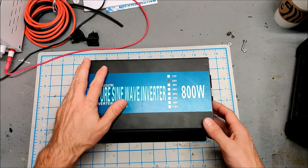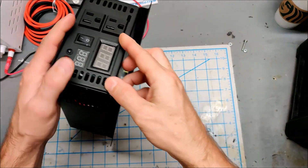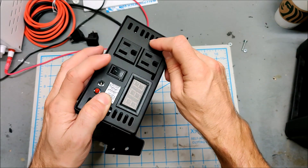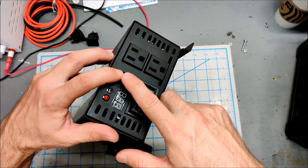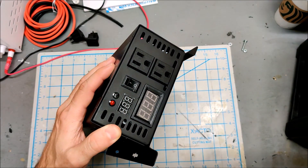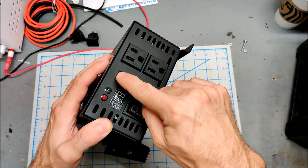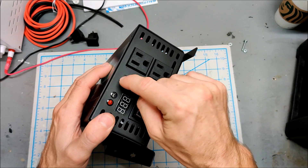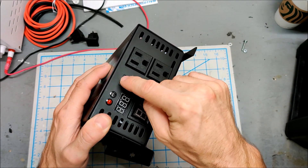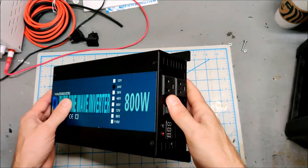Quick tip for when you're building solar generators: it would be nice to be able to turn on the inverter from outside the case with your own switch, but cheaper inverters don't have a hookup for an external switch. Some fancy inverters have pins where you can hook up your own switch, but cheaper ones don't. However, we can totally wire our own switch onto this switch and run a wire out externally, just bridging this switch with ours. This switch doesn't actually carry any current — all it does is flip an internal relay. So any small switch with small wiring will be more than enough. If you bridge the two wires, both the internal and external switch will work.